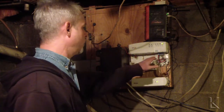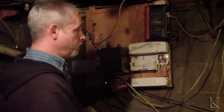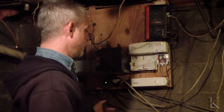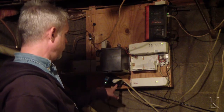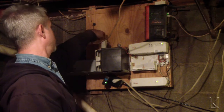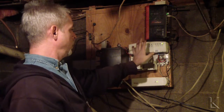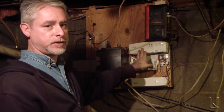There's no problem with tying that ground to the electrical ground — no electrical problem — but check it with a meter. Make sure you don't have 20 or 30 volts difference between the two before you tie them together. What I'm going to do is run a ground wire from the electrical outlet here up to this screw that I put in the wood, and anchor a ground wire to the negative of the battery, which will ground the power supply and the outside terminal to the house's AC ground.